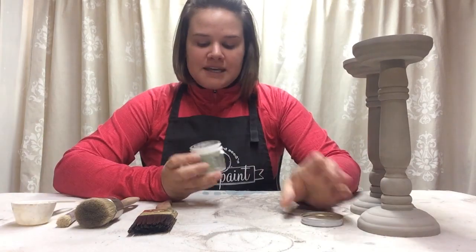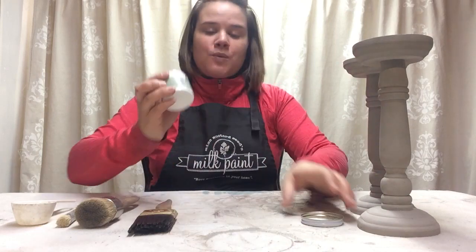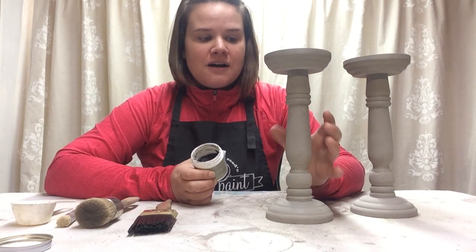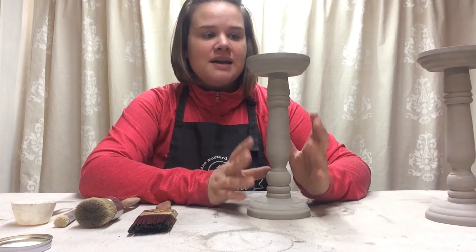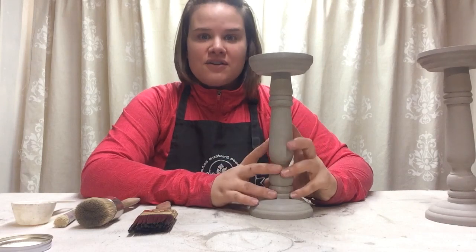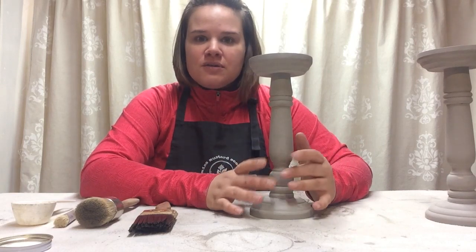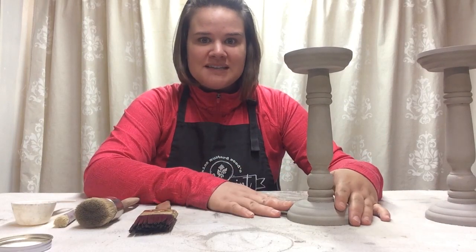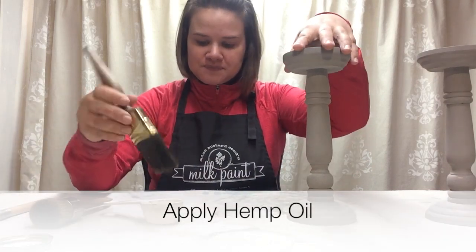Let's talk about antiquing wax. It's a really dark, beautiful tinted wax that adds a lot of depth and character. What we're not going to do is just dip our brush in and start waxing right out of the gate. You really should have some sort of layer of protection on your piece first before doing a colored wax. The reason is you want to preserve the color — applying antiquing wax directly over milk paint with nothing in between can make your color go muddy, cloudy, or almost ghosty.